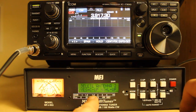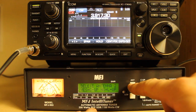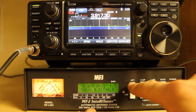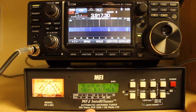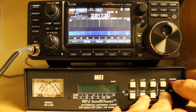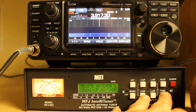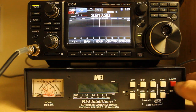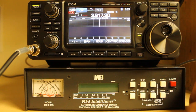You'll get a message that says DELETE ANTENNA 2, and you can press C UP. You'll also want to do the other antenna, so it'll switch to 1. Power off, hold down C-DOWN and TUNE, power on. Delete Antenna 1 — C UP for YES. That's just going to delete your antenna memories.